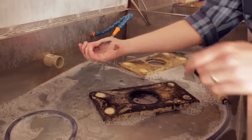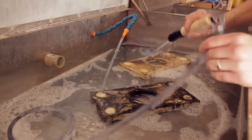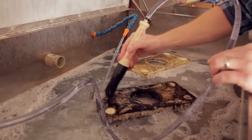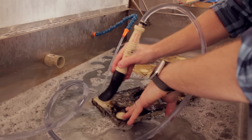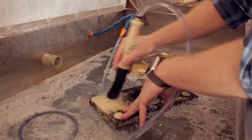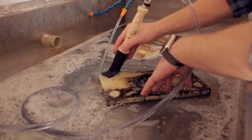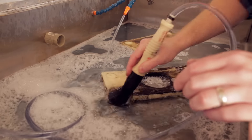So I'm going to clean some of these parts here. Both of our washers come with both the higher pressure nozzle and the brush with fluid. The heated solution does a good job of breaking down oils and greases on your parts. If you want to, you can stop up the drain and soak parts overnight or for a couple of hours to do a better job of clean up.